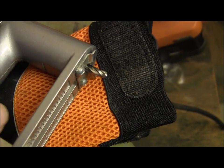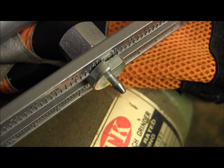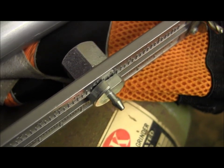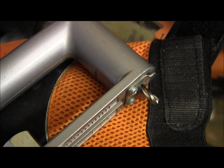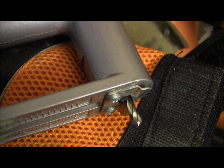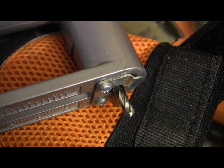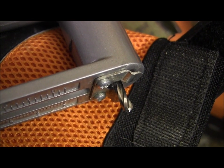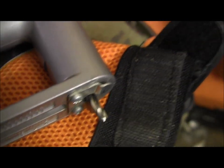And so what happens is this thing goes into the pilot hole. There's your pilot, and it's adjustable. It'll cut up to 16 inches. And what you do is you spin it around with the drill, which is tied to the shaft up here at the top, and there's a bearing in there, and that's what cuts out the disc. And it comes out exact every time. And there's even a little foot on it, you can see right there. That foot keeps the metal as a lead edge so that you don't fight it. And all your cuts are made in a clockwise direction. They come out perfect every single time. You set it once and forget it.